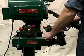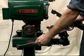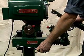To obtain working clearance and move the drill holding unit away from the wheel, release the drill point angle clamp handle for the shaft holder and move the lever forward to a horizontal position.